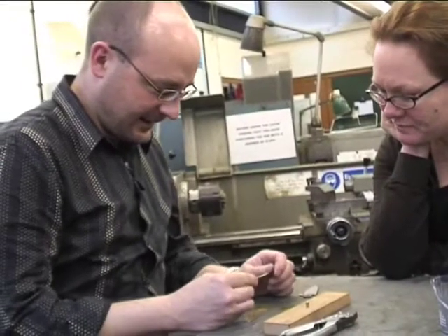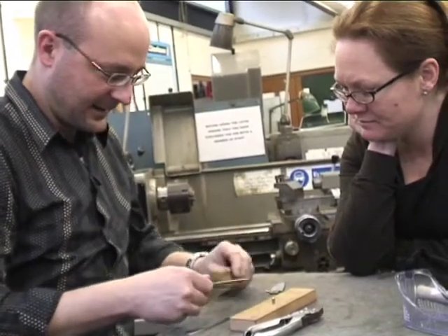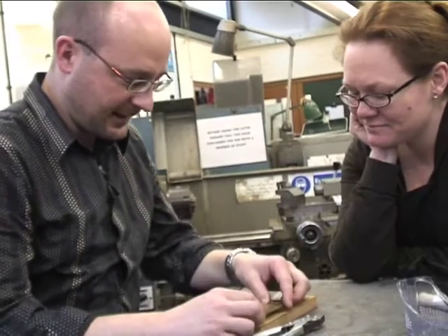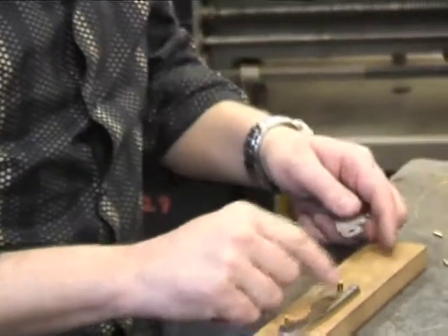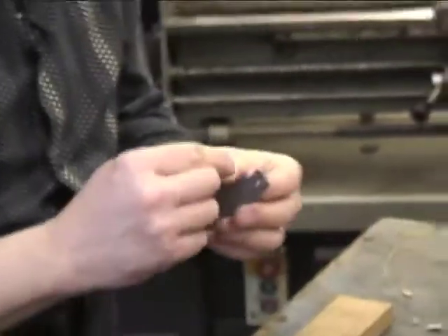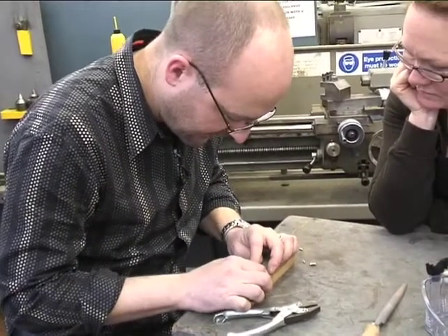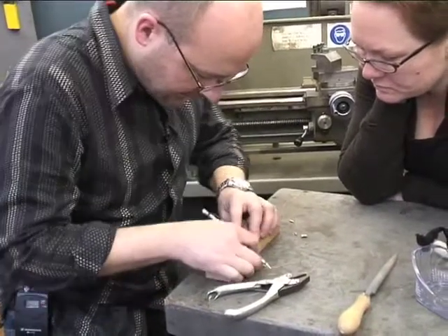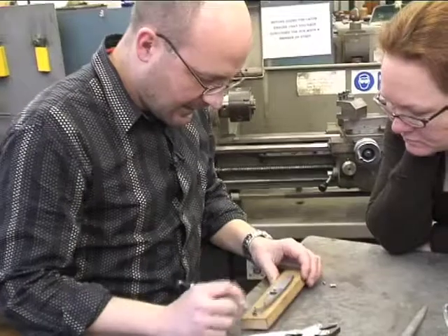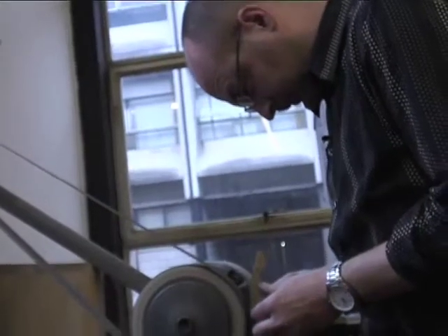That was the spine and I've nibbled at it a little bit — I roughly made some sides last night and then stuck the sides down onto this block just to make it all easy to manage. I had the spine set up and the blade had been 90% shaped, and it was then a matter of holding it in place and estimating how much needed removing to get it to engage. After a bit of trial and error fitting, I got it to go together, and then the first task is to use the linisher to get a nice curve on the back of the spine and blade.